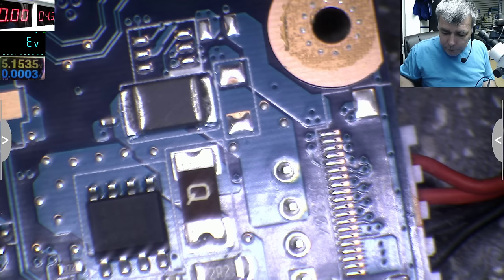This is just a switch on this configuration, on the input. But they are complex semiconductors. They are working on the power supplies as switching devices, yeah? But not here. Here is just a switch. So, you see, my problem is on the output, we have 0.9. And obviously, if I go after this one, I have 0.9. And on my current resistor, we have 0.9. So, you see, actually your voltage stopped there.